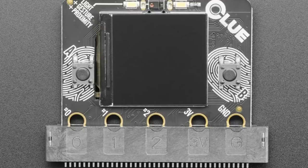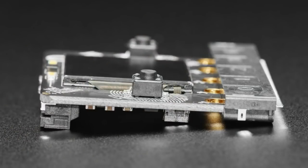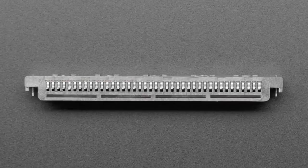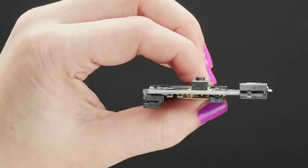What's nice is it has little notches that tell you which way to plug it in, because it only has contacts on one side, just like the Clue or the Microbit. This one is a sunken type PCB holder — you have a cutout in the PCB, and this sinks in so that the PCB and the Clue or Microbit are co-planar, in line with each other. This is different from other connectors where it would float above. It's good if you want it to slide into a bigger shape and be flat — less bulky, more evenly distributed. Slimline.